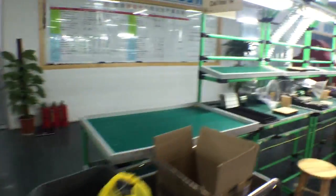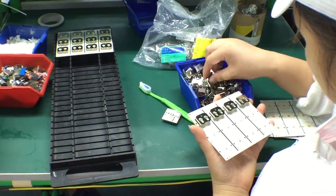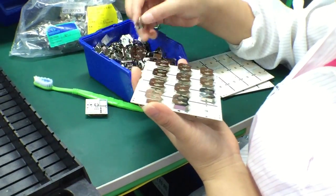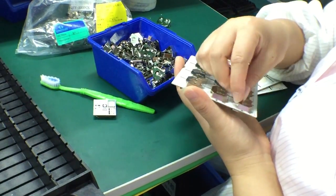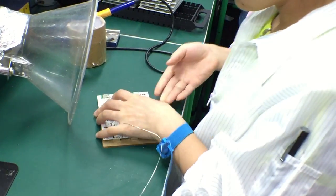These are the actual light bands that are going to be used at the Solid conference. The surface mount soldering part went through the oven, but now the last bit we have to do is put these actual battery clips onto the board and solder them on by hand. So now we have to solder the battery sockets on.